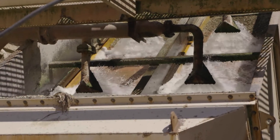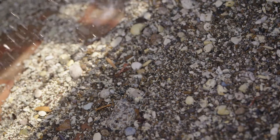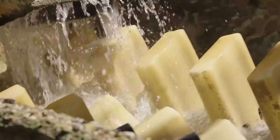Your primary flume screen is the first screen you hit when you come out of the distribution box, and it's going to remove a lot of clays and a lot of your smaller sands. Then it moves to the primary vibratory screens, where we're using water to wash it and separate out that quarter-millimeter-sized product. Then it gets to the log washer, which mechanically tries to break up those larger pieces into smaller ones.